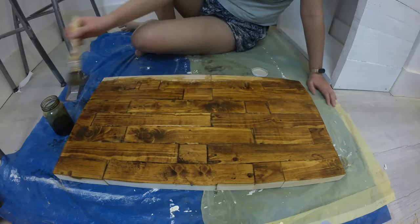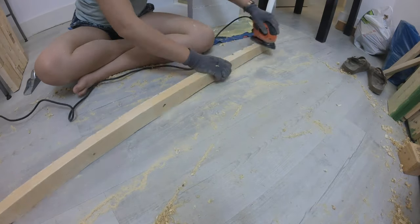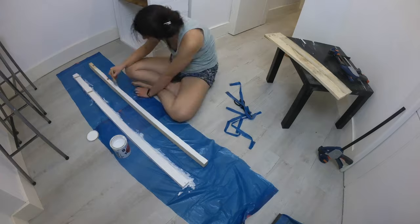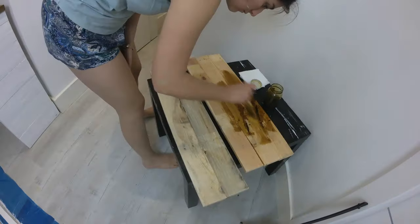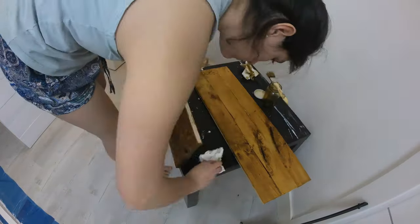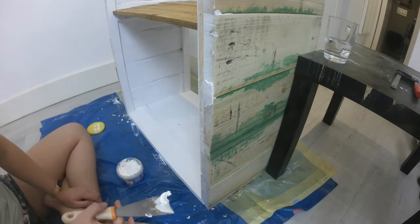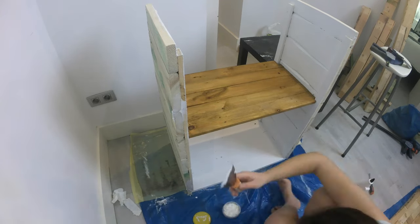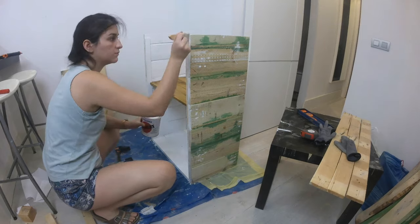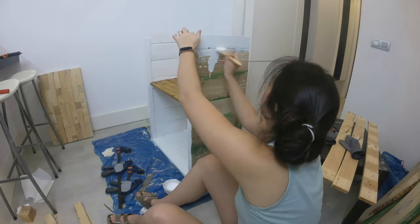Keep in mind this project is going to look a bit rustic, as a consequence of the materials and tools we are using. I honestly enjoy the look, but as I am learning as I go, feel free to give your advice in the comments section to help us all get better at woodworking. After sanding down the pieces for the upper shelving, we can move to painting the sides and tinting the shelves. And before painting the rest of the cabinet, I decided to fill in the gaps between the boards on the front to make it look like a solid piece. You can also choose to mask this gap with a strip of wood. Give the sides a nice two coats of paint and leave to dry for at least two hours, then nail the counter to the top.